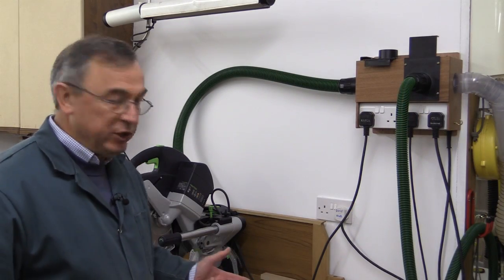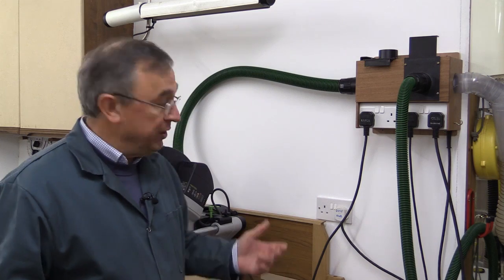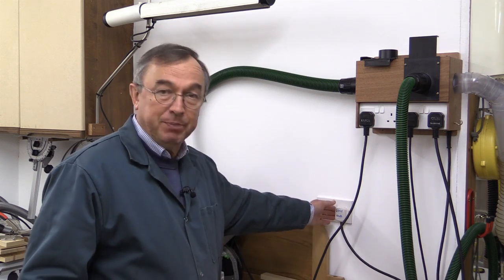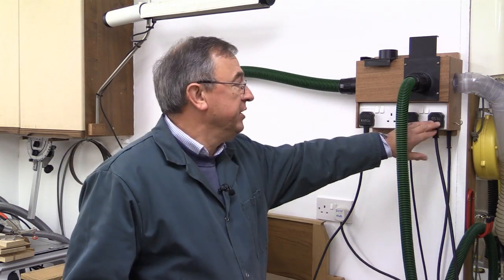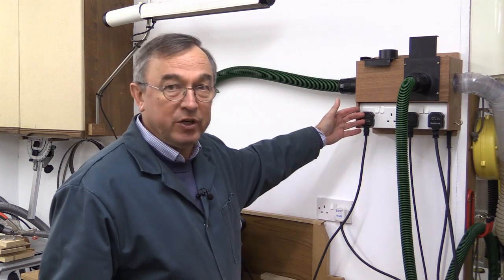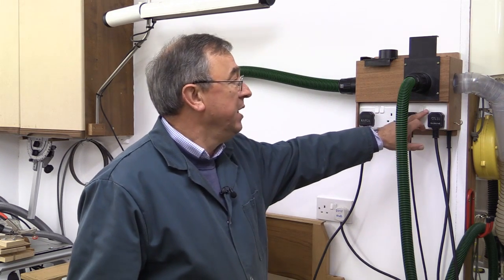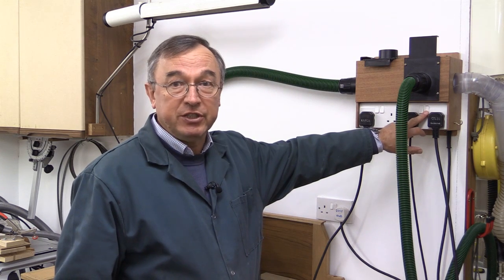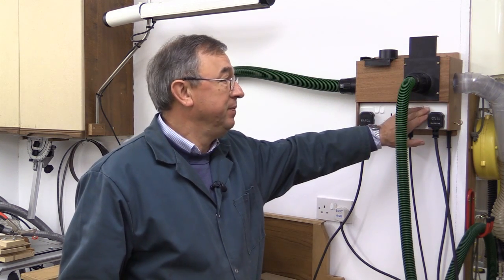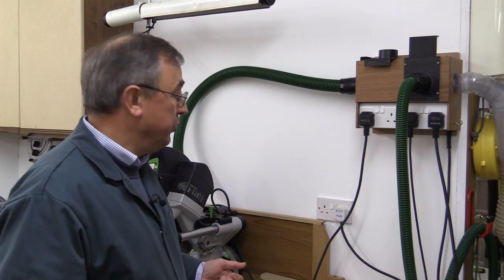So if you're not lucky enough to have a Festool extractor which turns itself on and off whenever a tool plugged into it gets turned on and off, you can do as follows. Plug the dust hub into your wall socket and turn the power on. Then connect your extractor to one of the sockets on the dust hub and your tools into the other sockets. Follow the same routine of switching things on and opening blast gates, and whenever you need to start the extractor press its switch. Then press the right switch for the tool, checking that its blast gate is open.